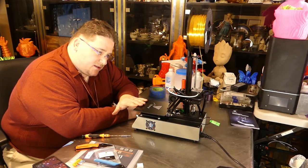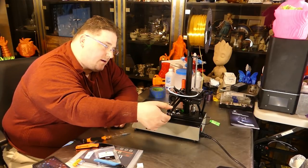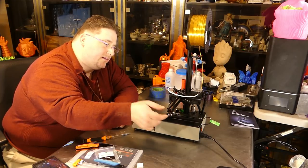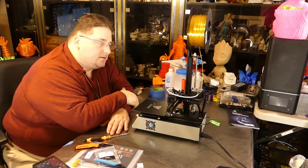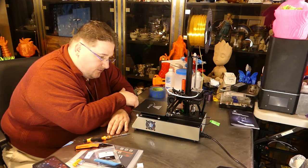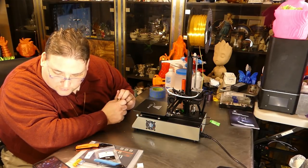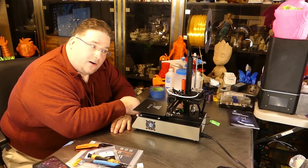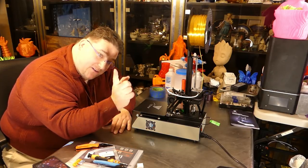Going to preheat — selecting ABS preheat because this is silk and I run silk at 220–230 depending on speed. Heating up: 35 degrees and climbing — this thing heats up fast. Without a heated bed slowing it down, it just cranks away. There is one consequence to this printer though. The gantry and frame — nice and tight, not a single wiggle. There's a tiny wiggle I'll have to tighten up, but otherwise it's perfect. We are 12 minutes in and the printer is ready to go — and that's me dilly-dallying adding a spool holder and talking.